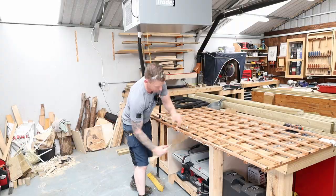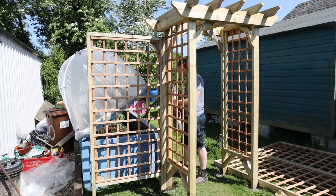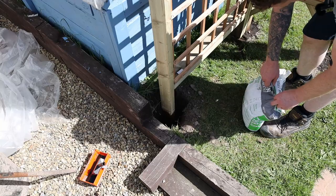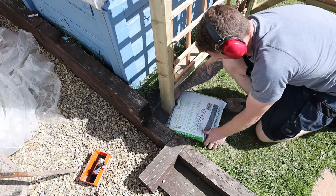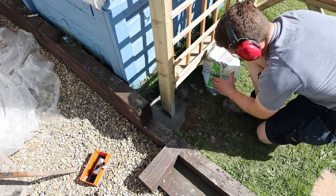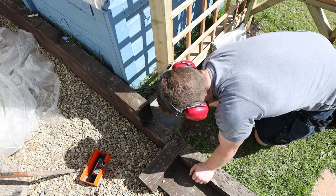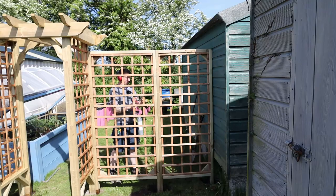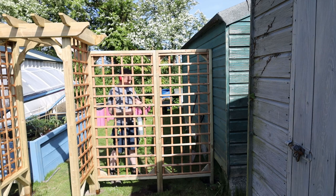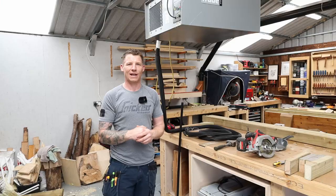All three screens are complete and now up in place. Just like before, I dug some holes and treated the bottom of them with creosote for extra protection for the timber going into the ground. Make sure the treatment you use is rated for in-ground contact — creosote is what they coat telephone poles in. Then I used post mix — K Post — you can throw it in dry and just add some water around it. Ask for post mix at your local builders' providers. I've screwed everything in place and attached it to my shed, but the tops look a little plain.